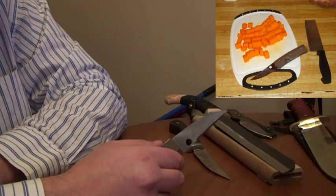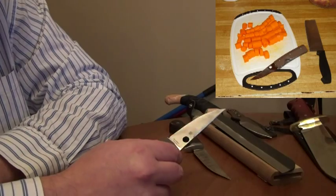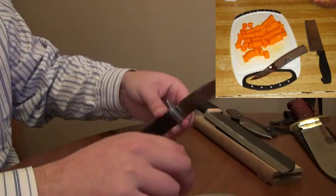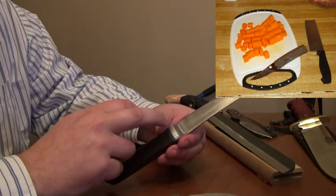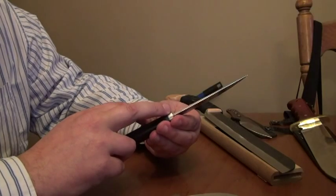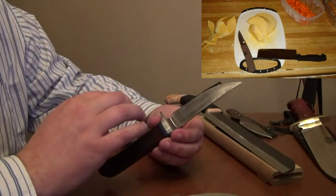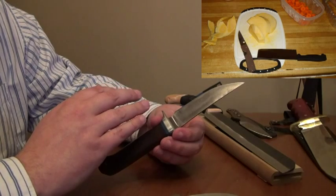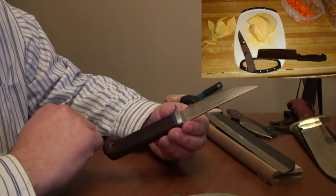And again, to try to make this as drastic a comparison as I can, this is a custom from Phil Wilson. It's a Coyote Meadow, really nice knife. Phil normally uses full flat grinds, relatively thin stock, distal taper, and his edges are around 5 to 10 thousandths thick, usually around 15 degrees per side. And he's well respected for the level of cutting ability of his knives.